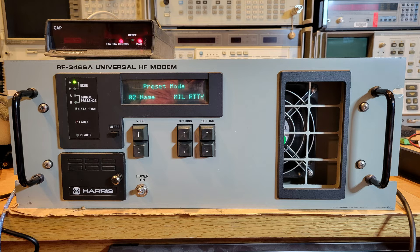The unit is designed to take audio input from a receiver, for example, where the audio contains a keying waveform such as RTTY FSK, and convert this into a serial series of bits for connection to a computer or other digital equipment, such as digital voice converters or facsimile machines. Likewise, the unit will take serial input of data from these digital devices and modulate them to the configuration of the selected waveform and send that modulated waveform out as audio for use in a transmitter or telephone circuit — most typically, a transmitter.